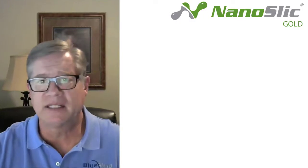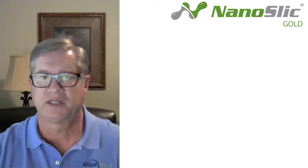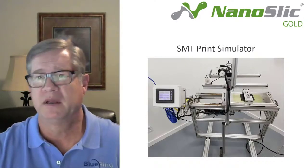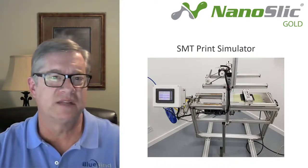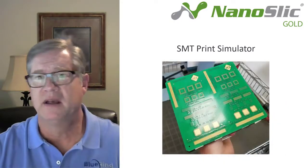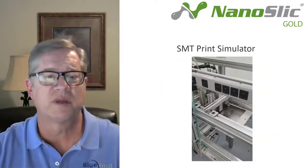We needed to develop a piece of equipment that could simulate high squeegee print cycles in shorter time increments versus a standard stencil printer. We successfully designed and built this piece of equipment and refer to it as our SMT print simulator. This equipment allowed us to make incremental changes to either the coating chemistry, application process, or curing process, then test print thousands, 10,000s, or even hundreds of thousands of print cycles.